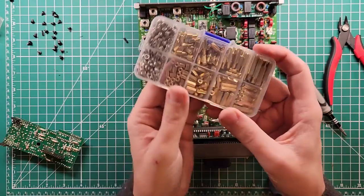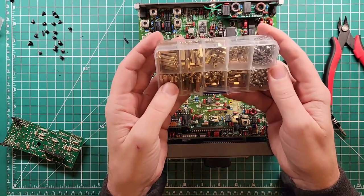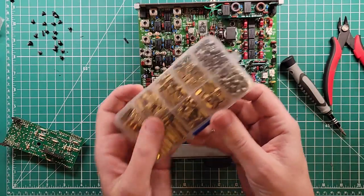There are a couple of reasons why I just put the pin headers in place on here. One is that puts them into perfect alignment when I go to put it into the board. The other is I need to figure out how to stack up the standoffs to give it the right amount of standoffishness. I went to Amazon to get a pack of standoffs because I wasn't 100% sure what height would be needed. I have standoffs, nuts and bolts, and screws.